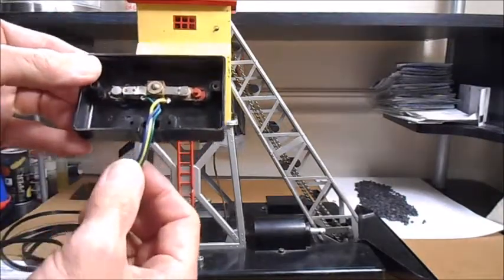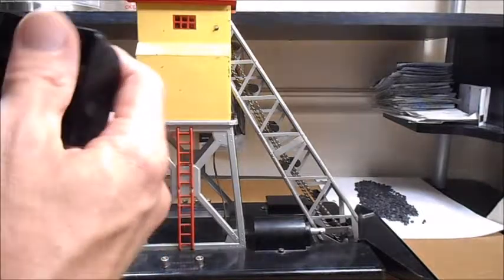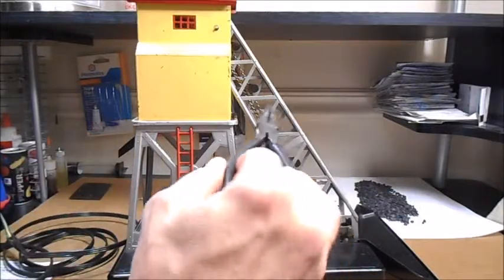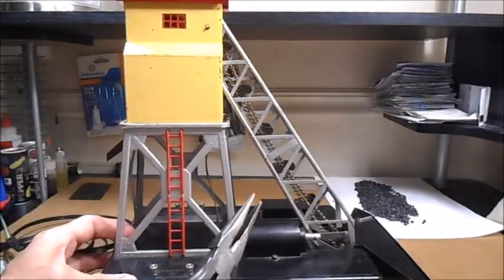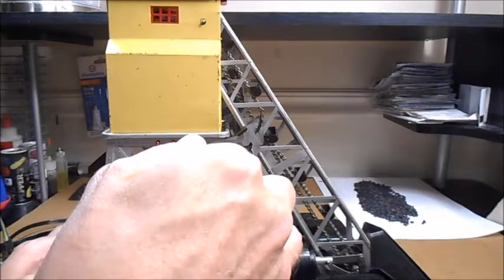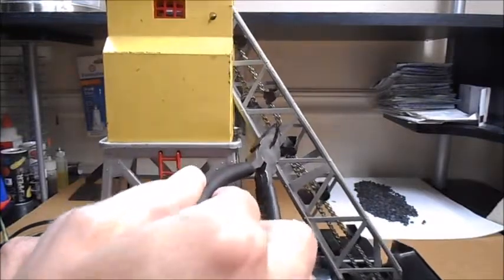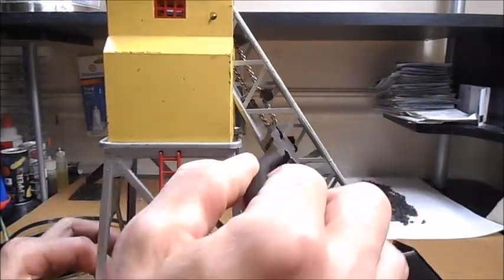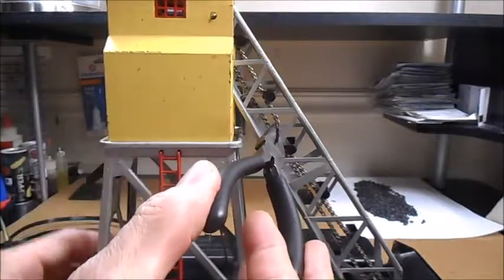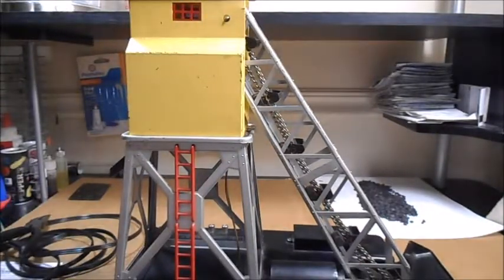The tensioning on this chain — why is it so loose? I have no idea. I got it at a really good price, but I know that with one link, if I grab it and twist it 90 degrees, I can tension up the chain without even pulling on the tensioner at the top. Looking in the Greenberg service manual there's no mention of a tensioner and not even a detailed parts diagram.